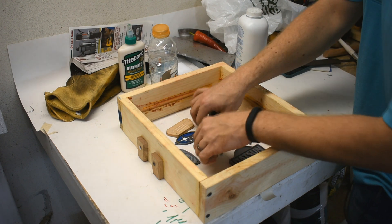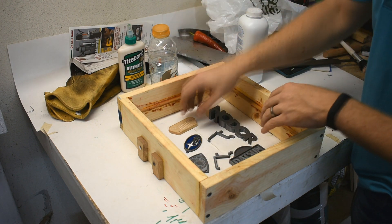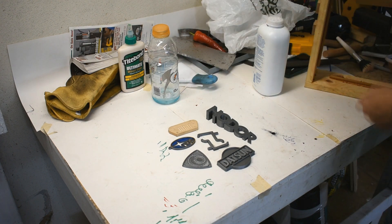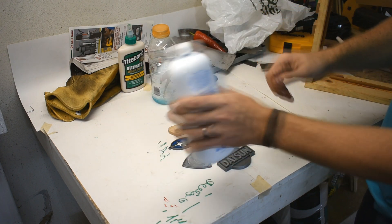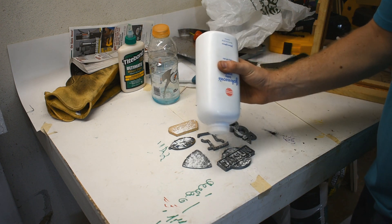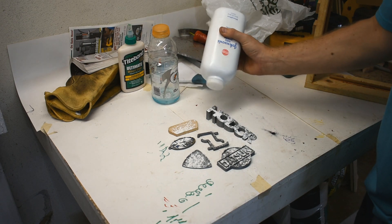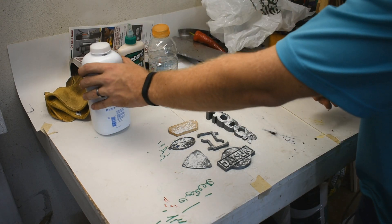Let's get arranging. I'm not going to do any gating — I'm just going to pour into the top. Someone suggested just dumping baby powder all over before putting the flask on, and that was a good idea. So much baby powder. I wonder how all the baby powder will fill the print lines and kind of hide the print line pattern. Just going to use tons of it.